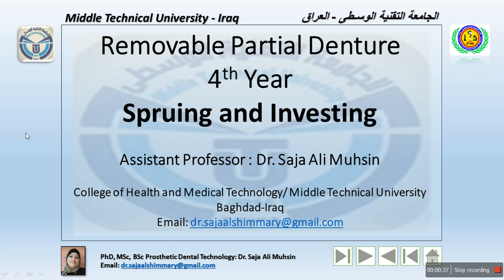Now, to achieve a complete restoration made of removable partial denture for cobalt chromium restoration, we need to go through many steps. We have designed the wax pattern. The step now is the sprueing and investing to prepare the mold to be cast into metal.